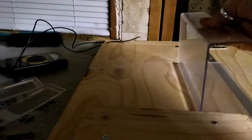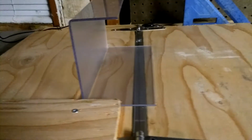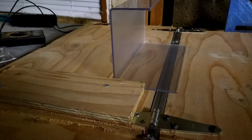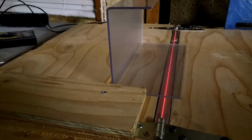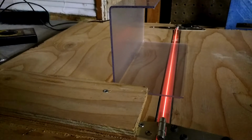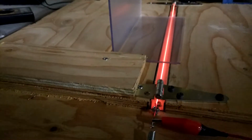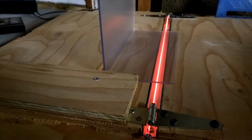What you do is you lay your plexiglass, and I've got a 90-degree guide here, so you can put it over the trace there. We turn our heat on, and as I dial up the Variac, you can feel it humming, and then you'll see the nichrome wire basically get red hot. And there you have it. You let it heat underneath until the plexiglass is nice and malleable. That's basically a resistance wire, similar to what's used in electric space heaters.